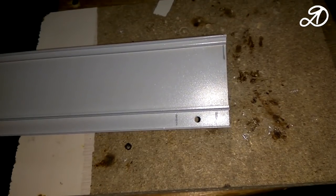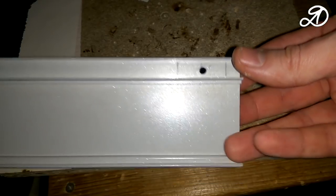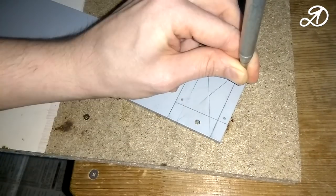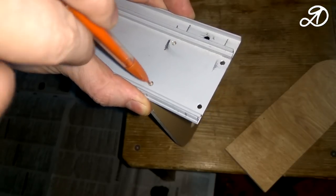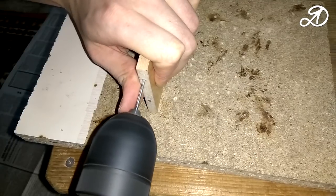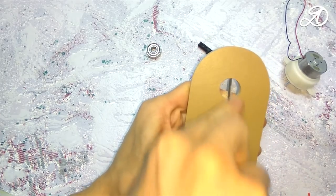This profile is a little different. Drill a hole for the output wire to power the LED strip. The length of the entire base is 138 cm. Now drill holes for the mounting racks — the main thing is not to confuse the location. Drill holes for screws in all four parts. Make a little hole for the wire.